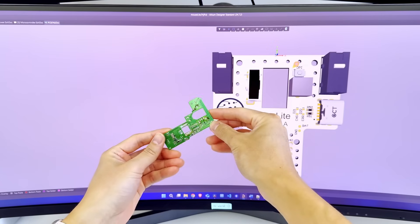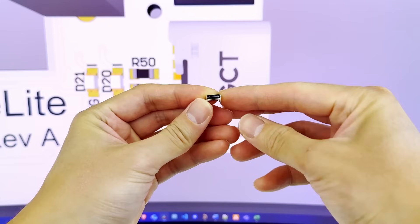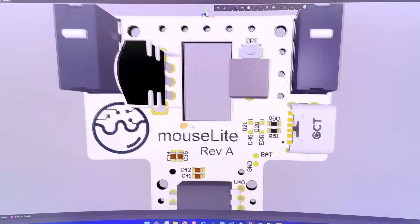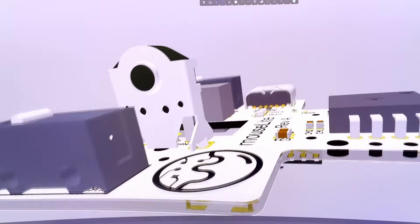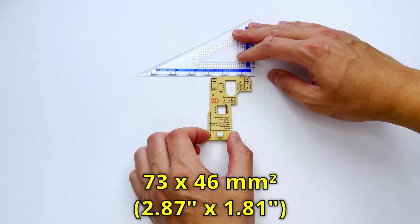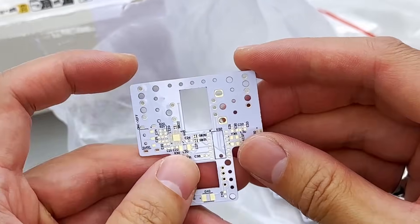Using our verified schematic, I made a new PCB with some important changes. First, I replaced the alkaline batteries with a rechargeable one, but this meant I needed a new chip to handle power management, along with a USB-C connector for recharging the battery. The rest of the circuit is pretty much the same — the mouse sensor, the micro, buttons for left, middle, and right click, DPI changing, and I've kept the same scroll wheel. The new PCB is 45 millimeters by 42 millimeters, much smaller than the original 73 by 46 millimeters — with a lot more holes. Our friends over at PCBWay manufactured the PCBs for us and did a fantastic job.